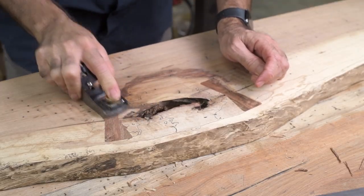For me, it's an obvious choice — I'm going to go with the block plane. It just has more uses. The edge trimmer is a two-trick pony since there are two edges on it, but the block plane has more uses: you can take down proud joinery, use it to bring down butterflies that I put in tabletops, and you can use it for end grain. So yeah, more uses for this, handier to have around, fits my hand better, and cheaper, really. So I like the block plane.